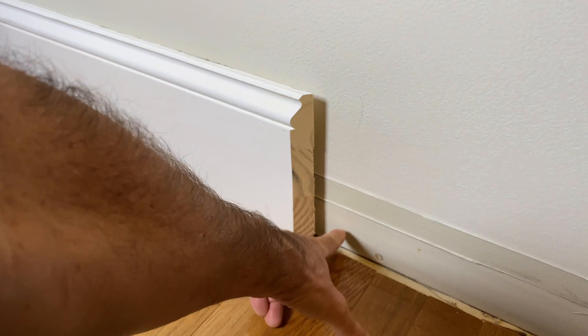The very first piece was flat to the wall on the left side — so obviously I can't cut this next piece flat too. I have to cope it. To get a proper measurement, run the tape measure all the way to the wall — not to the trim — and take your measurement. As you can see it's about 136 and seven-eighths. When you cut that on the saw, cut it at a 45 just like you would normally join two pieces together, and then you cope it. Normally I like to make the board vertical in the saw but this saw won't cut that deep when the board is vertical, so I'm doing it flat.